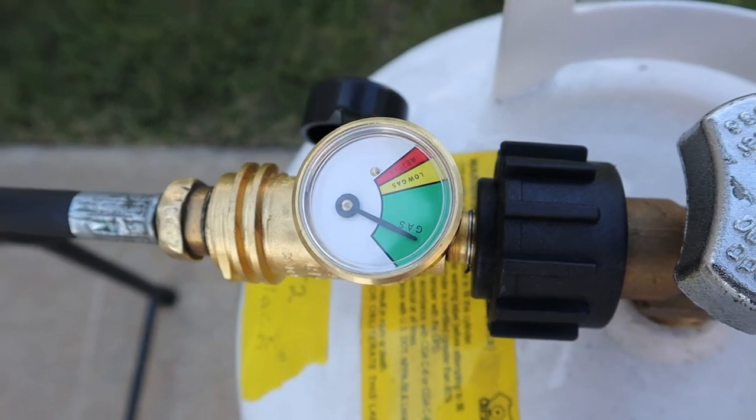The second issue was with the inline gauge — the Gas Safe model. It also has a leak detector built in: if it detects sudden high flow, it restricts flow to a very low rate. The tank itself has the same function. The problem is the leak detector is overly sensitive — I can't even run the torch at half power without tripping it. So I need to remove that for the test. Right now it's showing about the middle of the green section, but we know this tank is mostly empty — which pretty much proves the inline gauge isn't very effective.